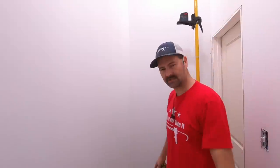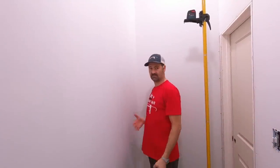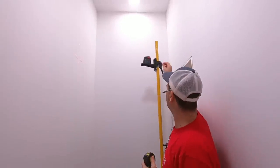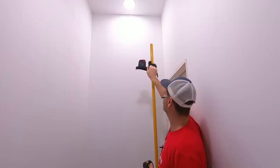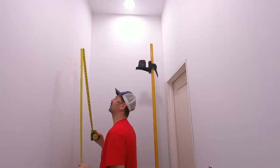There's a laser beam with spotlights on it. But I'm gonna make my marks on the wall from one position, even if I gotta turn the lights out. I gotta get my level line. Because this floor isn't even, my legs are not all gonna be the same length. At least I don't think they are. I'm anticipating them not to be. There's a little dial on this, so I can just dial it down without having to undo the clamp. So you're gonna come down one more eighth.